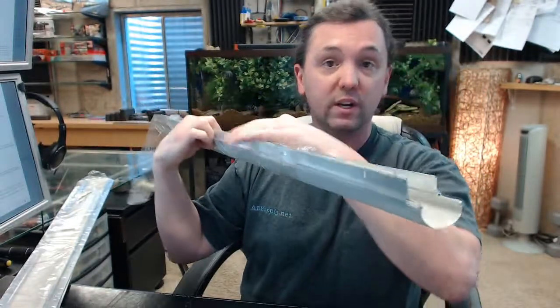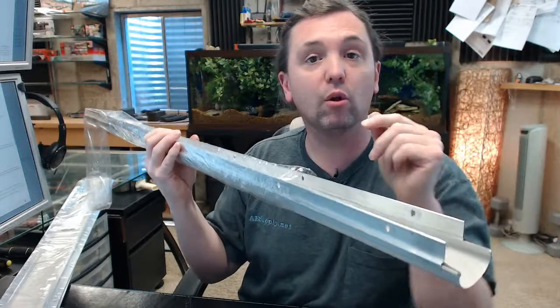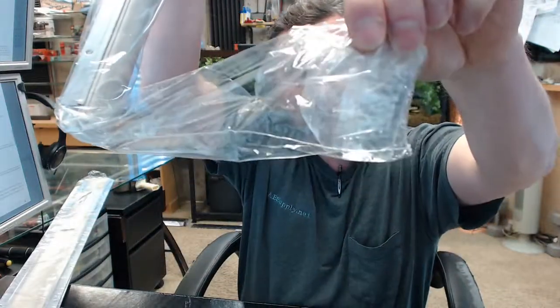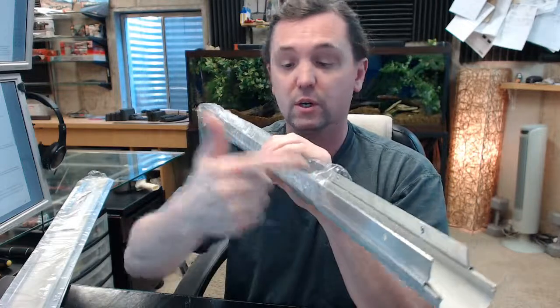For example, if you had a 36-inch piece and cut it down to 34 inches, you would all but eliminate the slotted hole at that end — the next one is all the way over on the other side. It's very nice to have those slotted holes from the factory because every sill is not level, every door is not plumb, and every jamb is not completely straight. Those slotted holes help account for those conditions. Screws are included in a complimentary finish. If you're installing onto a hollow metal door, that drill bit has a tendency to walk a little bit before it pierces through, and the door could have an inverted bottom channel — drilling through two layers of steel might be a challenge. If you order a custom length, it will locate the first slotted hole at the proper distance from the edge and the proper center-to-center spacing as well.